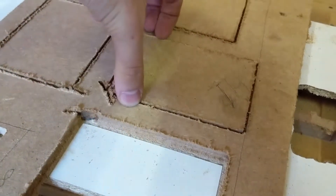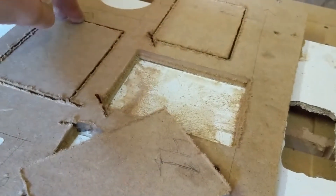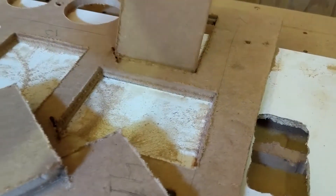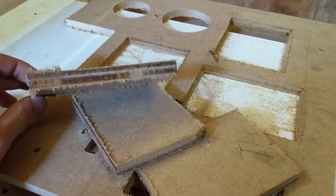As you can see, the end mill is burning the wood. This may be because I am using too many RPMs. I could maybe fix it by doing 4000mm per minute instead of only 2000.